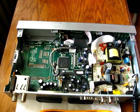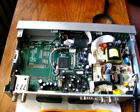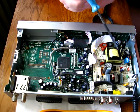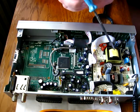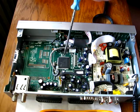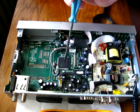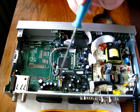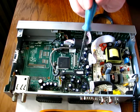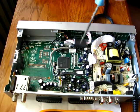We have the typical two board construction. One power board. This is a switch mode power supply and one digital processing board. This is this one. It's not much populated with ICs. I just see one customized ASIC in this receiver and some surrounding components like the quartz resonator or oscillator, a memory chip, probably SDRAM, here maybe a display driver and some voltage regulators.